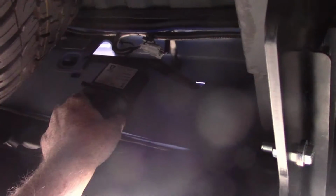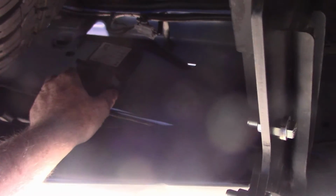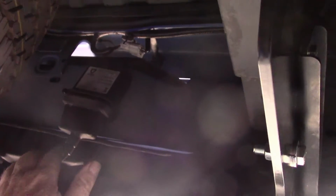That's the easy part. Right, that's the control unit up in there. You can see the spare tyres there. I mounted it in behind the spare tyre just above the tow-bar there. I didn't have the camera to do it because it was all done by feel. I needed both hands to do it. I had to drill a hole in this rear piece here. It's covered by the plastic on the outside so you can't see it. And I got the bolt through and done up with a nylock nut so it'll be quite secure.